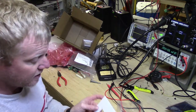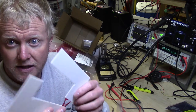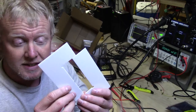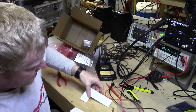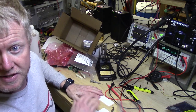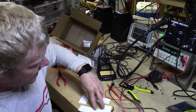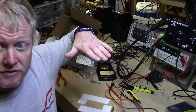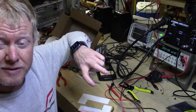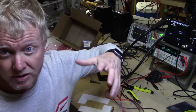On that particular one, I really did the same exact stencil method. The only difference is that I took my OSH Park stencil templates, I guess is what these are. Usually these hold the board at the correct level where you can just tape this down and stencil over it. On this board, I had parts on the back, so I had to have some overhang. I only used these to lift the board up so that the parts on the bottom wouldn't hit while I was stenciling, and I held it with my fingers. That's the fastest way I found to stencil these small boards, and it works really well.